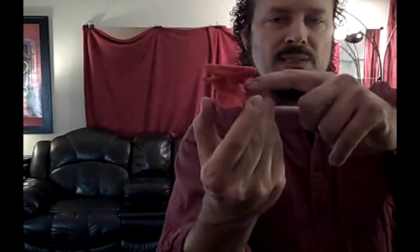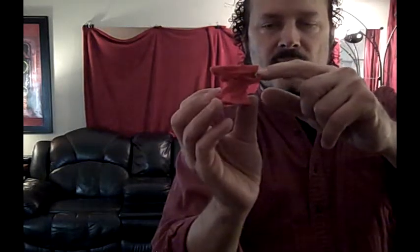There are issues, like little loops of plastic around towards the bottom, where the ears or the back of the jaw might be. It's because this is a bit too drastic of an overhang. Because of that, it droops and things won't build quite right. And yet some of this actually did come out pretty good.